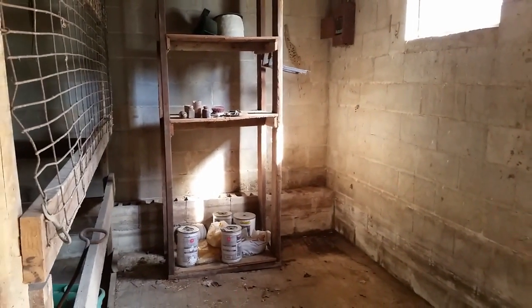Right here is where I just cut off that post, and it was completely rotten - you can see how it's been eaten by termites. It was a laminated post with three boards, and that center board went up through the middle where both joists are nailed to. You can see it's completely rotten with termite damage, and the termites got up into the actual floor joist itself as well. This is the only thing those joists are nailed to.